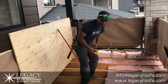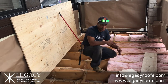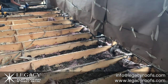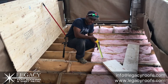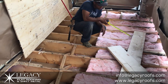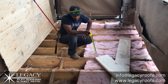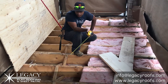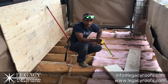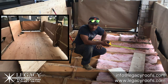Welcome back. We finished taking off the deck. There was a lot of rotten deck and we replaced it. In the process of replacing the deck, we also found the insulation was dirty and you don't want to reuse it, so we're putting in new insulation. We also had to do some framing on the outside perimeter. We've started putting in R20 insulation — that's a garage, so you don't have to go too crazy, but it's still an opportunity to keep the garage warm. Then we're going to put some new substrate on top of that.